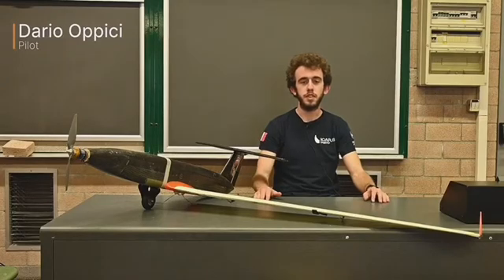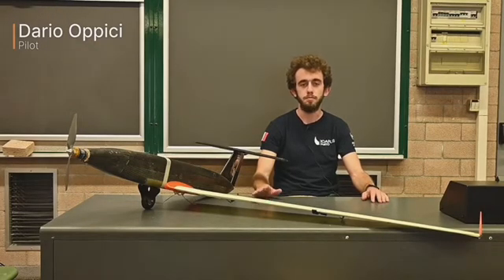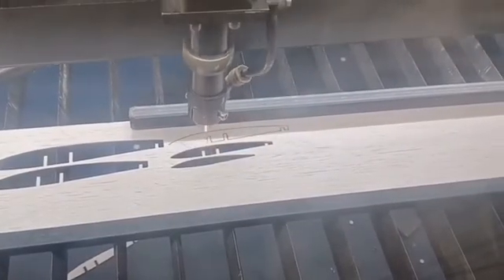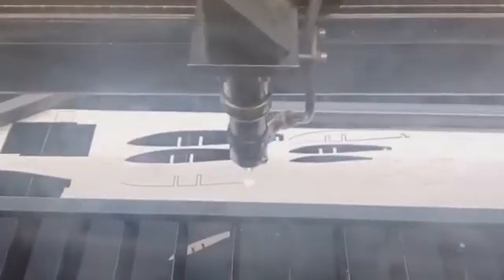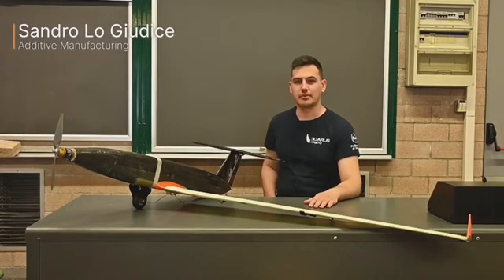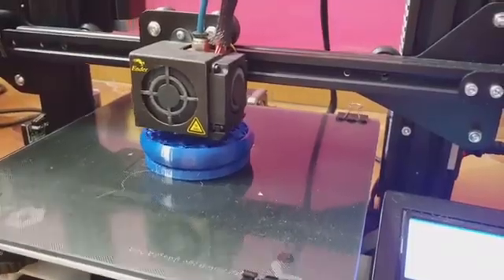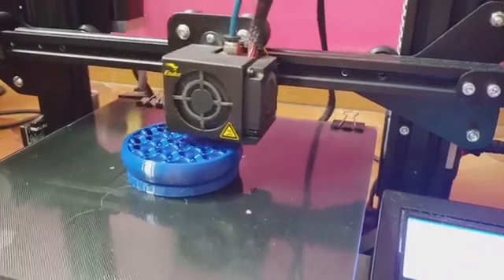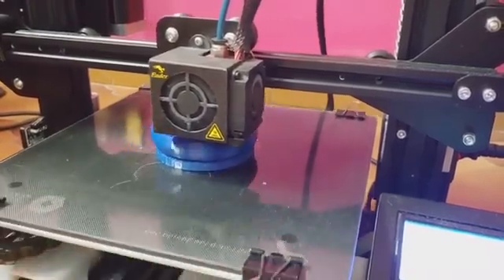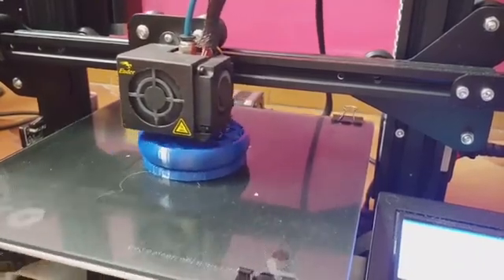Among the most recently introduced techniques for the construction of IKOR, laser cutting is the one that allows us to save a lot of time with better precision than performing by hand. This machine is able to cut quickly and with tight tolerances a wide range of materials such as balsa or poplar. In the video, you can see the laser in action cutting the internal reinforcements of the wing — fundamental components for obtaining good structural behavior while preserving the lightness of the aircraft. Finally, one of the assets we rely upon in every edition is additive manufacturing. This technology is unrivaled when it comes to building complex shapes with a good surface finish. We used it to produce components like the wing-fuselage fillets and the winglets, which would be nearly impossible to produce by hand. We are also planning to develop a 3D printed wheel for the landing gear, which could fit perfectly with the weight and take-off constraints.